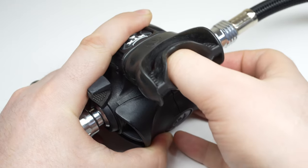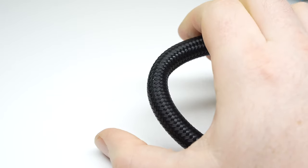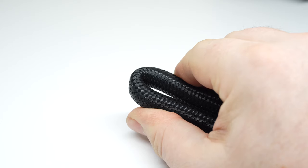If you do have a free-flowing regulator, the best thing to do is to block the mouthpiece with your fingers as soon as possible. If that doesn't stop it, you can crimp the hose to try to restrict airflow to the second stage and then gently open it back up again to resume normal function. But if the valve has frozen open or the mechanism itself has malfunctioned — slipped an O-ring or something — then the only way to prevent losing all of your gas is to get to an alternate air source and close that cylinder valve. A pre-dive switch is a very useful thing to have on a regulator, especially octos or regulators that are going to spend any time in the water out of your mouth.